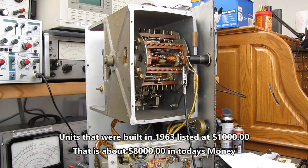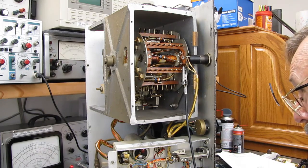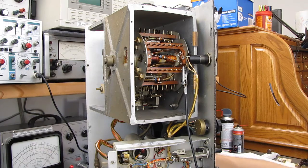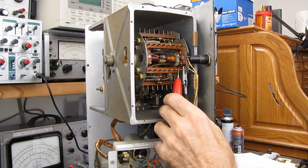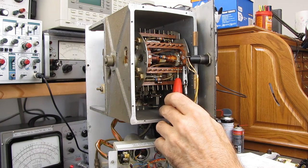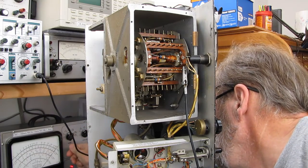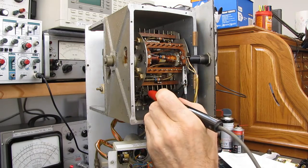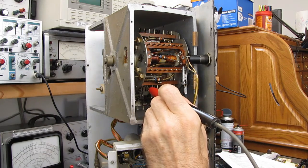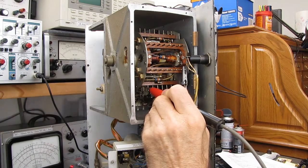Let's see. We have to go 688K to pin 8 from pin 1, so I'm going to have to range up. No, we're on the 10K setting. Actually, I should check that continuity in a lower range. Still have continuity? Can you see the meter? Yep, good. Okay, let's go up on 10K range. Pin 8. What do we got, guys? I can't see the voltmeter from here. Oh, 68 on the money.